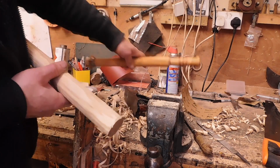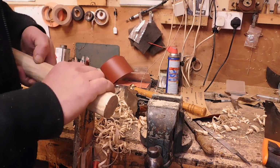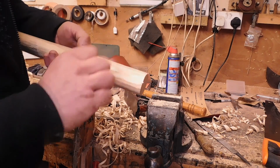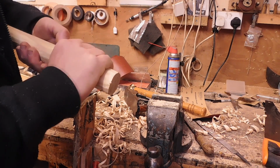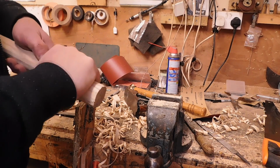It's a reenactment thing these days, that what you do is you make the grips massive, so that, you know, if you've got really big hands in your really big gauntlet on a really bad day, your hand will fit. Well, they weren't like that. They were tight and they were snug. Because the idea on any mace grip or dagger grip is when you grip it tight, you are squashing your hand in there, so you get something really positive. So I'm not going to put a big grip on this. It shouldn't be a big grip. It should be small and it should be tight.